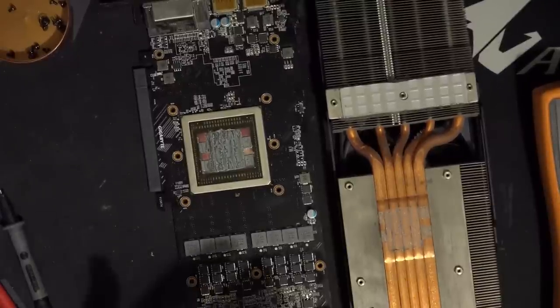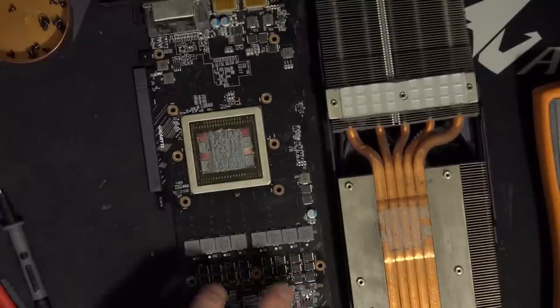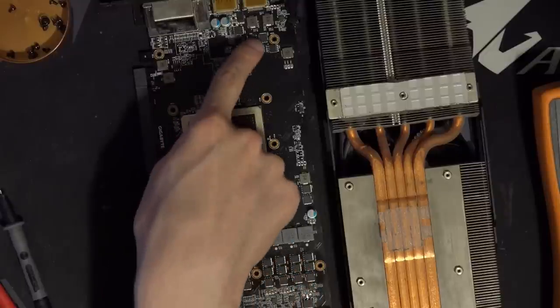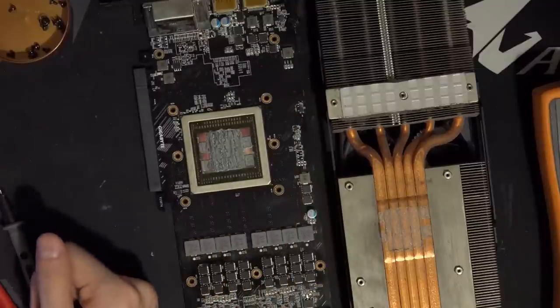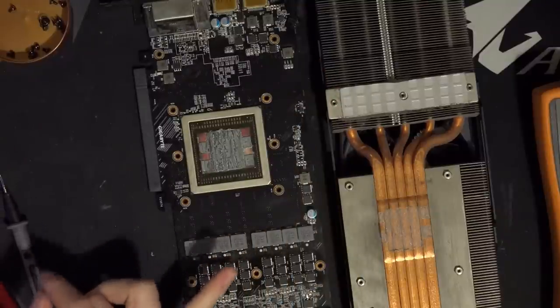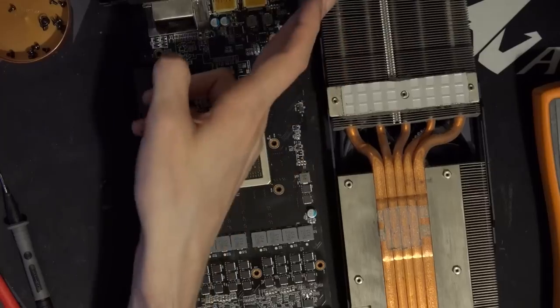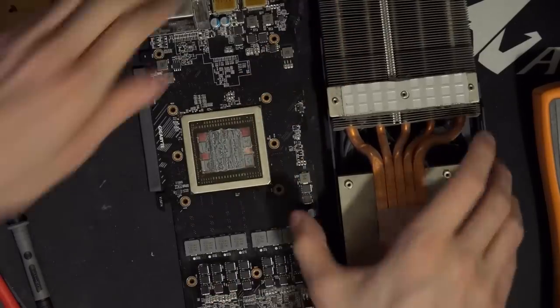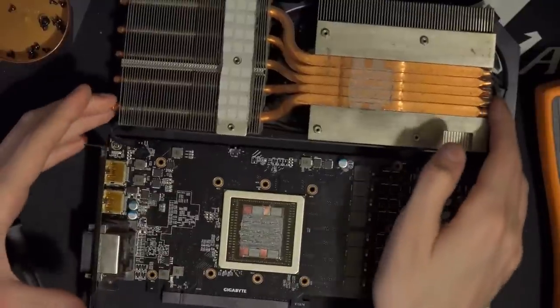And then also, the other downside to this card design. As much as I like what they've done in terms of the vCore power delivery, the VCC, well, actually, VDDCI probably doesn't matter, that they need to make it do a U-turn. Obviously they've extended the PCB to the point that it reaches all the way to the end of the heatsink, and one of the big advantages with the reference PCB for the Furies is that the PCB is this long.